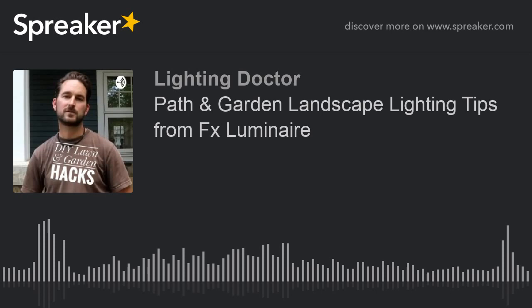In this final area we're trying to get some light over to the gates, to make people aware of the entrance way into the pool. We had a couple of choices — we could have used some path lights, but we decided to go with the FC ground wash. This is unique — it's low profile and not going to get kicked, bumped, or broken. With a lot of kids and families coming through with pool toys, path lights we thought would get destroyed. What I like about the fixture is it's very unobtrusive and out of the way — most people wouldn't even see it during the day. But at night it does a really nice cast of light right across the hardscape.